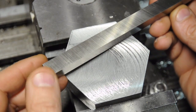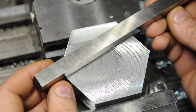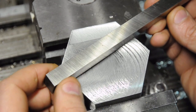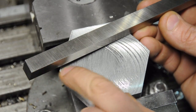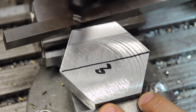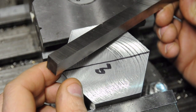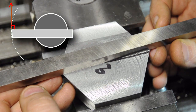In theory you could install this blank almost anywhere on the face of the fly cutter, but with some forethought you can minimize the amount of grinding needed to shape the tip and get the proper geometry. Typically on a fly cutter you'd want either a neutral or positive cutting rake, though it depends on the material. To minimize how much geometry you have to grind into the high speed steel blank, the tools are installed with the cutting edge coincident with the center line of the head - in my case point to point across the hex.